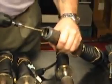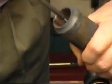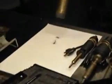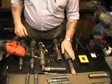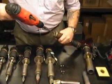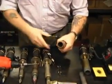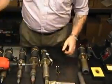It's a very simple method. We'll introduce the bore brush inside the heating element in this orifice. You can see the rust in there probably if my lighting's good. Now if you want to pan this way, you'll see we've got some actual oxidation, contamination. This is caused by flux vapors and a variety of other things that get in there and inhibit the thermal transfer into the tip. A nice quick little orientation of this bit in here is going to remove quite a bit of whatever is in there, and of course this one has a more minimal buildup than the other one had.